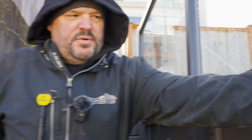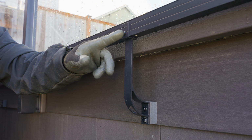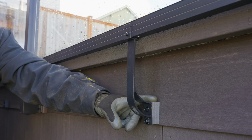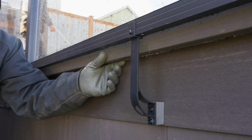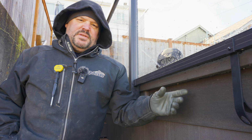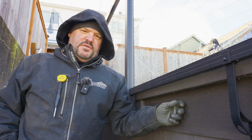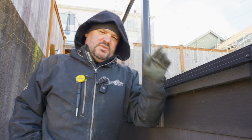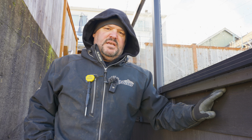And then we came back and put in these middle support stanchions, which again, just one screw here and two fasteners here. We had to fur them out as well from our fascia that tucked under, all because it's a waterproof deck system, and that dry joist EZ that we did had to cantilever out past the end of the deck for a certain distance so that the water doesn't have a capillary action and try to creep back underneath this and get the inside of our garage wet.